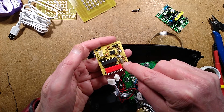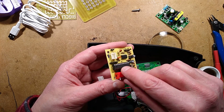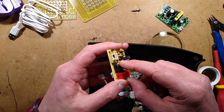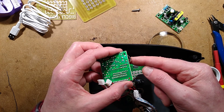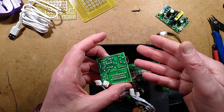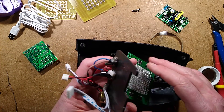I'd guess this is an LM358 op-amp. And this is the microcontroller with no number on it, which is doing all the work. There's a little crystal next to it - pretty much what you'd expect. The diode is going to LED out - that's possibly to drop the voltage to the LEDs very slightly, or maybe it's polarity protection. We don't need any of that anyway.